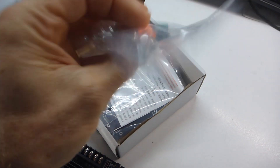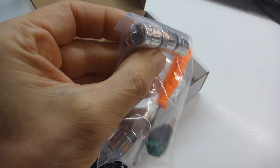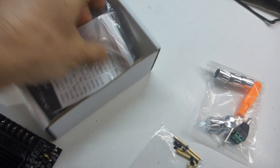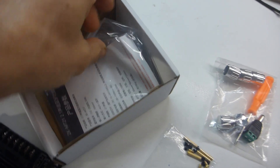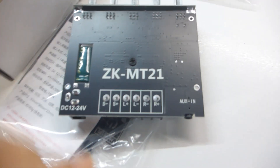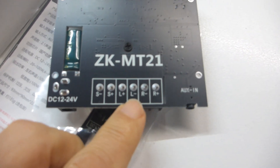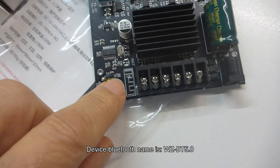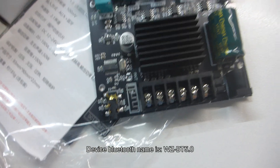First impressions are excellent. You get some little knurled aluminium knobs made of the thinnest aluminium. You get all these spacers that go between the board and the top plate, which is in this plastic bag here — top plate and the bottom plate. It looks like you've got Chinese instructions, but it's all pretty straightforward. There are pins on the back labelled: subwoofer negative, subwoofer positive, left, right, DC 12 to 24 volts, your auxiliary in, and there's a Bluetooth aerial here.